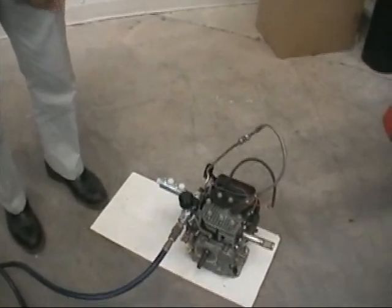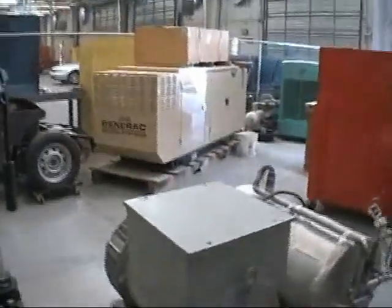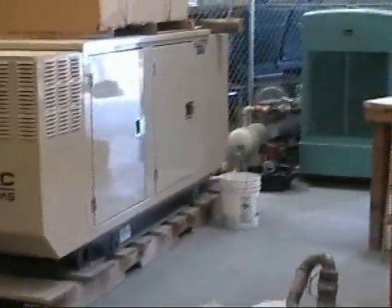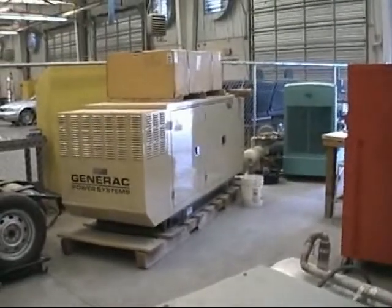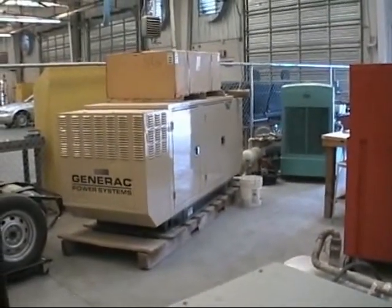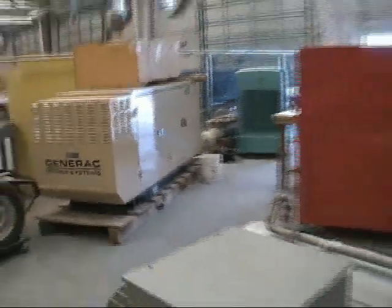Or if you take your TESI to an area that's had a disaster, TESIs of any of these sizes that we build up, such as this larger unit over here and still larger unit in front of it, can go out and meet the requirements of a community in terms of producing their power, cooking their food, providing space heat, and potable water as a result of on-site conversion of latrine wastes and the debris from the disaster.